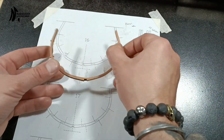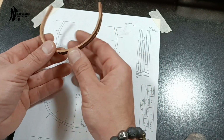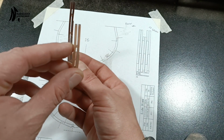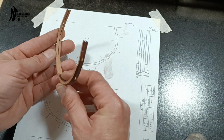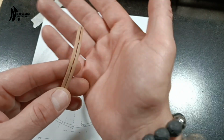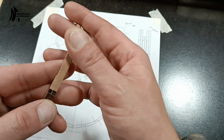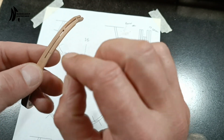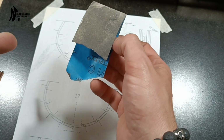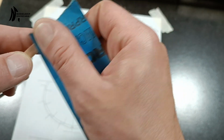And so guys, after drying, I sanded one part of the rib. Another one is still like it was before sanding. I want to show you the difference. Now you may have some small gaps, guys. I showed you previously many times in my videos. If you have some small gap, you just put a little bit of the white glue, you wipe it up, and then with a very fine sanding paper, you just start to sand it down, so it will just disappear,